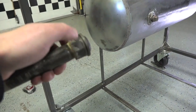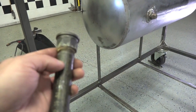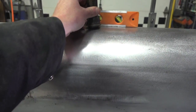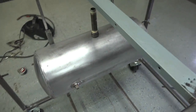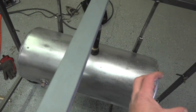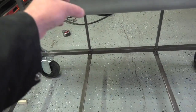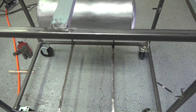It's a three-quarter inch union. This nipple I'm leaving in there to protect the threads from the weld. I'm just going to find a good position - whether I come out the front here or come off the top. From there our fittings come out with a tee and it'll split to two different ports for the bottom of the table. The tee will have one line going to the pump sitting here, and the other one going to the vacuum gauge at the front of the machine so I know how much pressure I've got before I start the project.